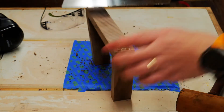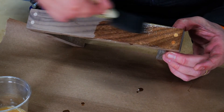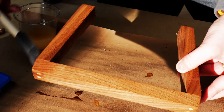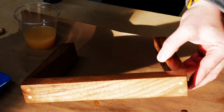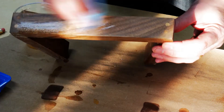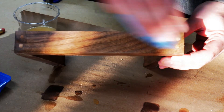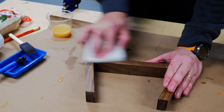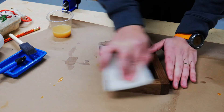I saved you guys from watching any of the sanding, but there's a lot of sanding in between all these steps. Here I am putting on some shellac — this is basic shellac based off a technique by David Picciuto from Make Something. I put an initial coat of straight shellac, didn't water it down at all. Afterwards I added about one-third to one-half denatured alcohol to thin it down. In between each coat I sanded with 220-grit sandpaper. For the last coat I used just a paper towel instead of a brush, with just a light sanding using one of those white sanding pads before putting on some wax.